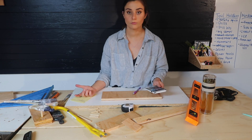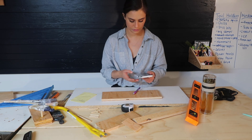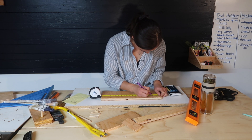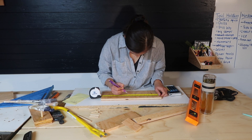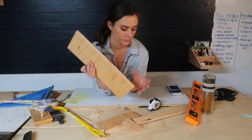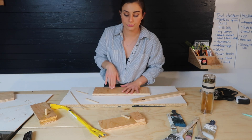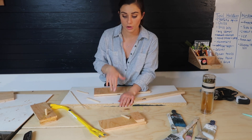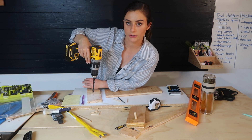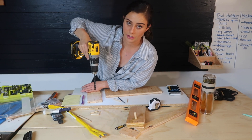I got my straight line — 14 and three quarters inches divided by seven sections equals 2.11 inches. So I'm marking every 2.11 inches along that line where I'm going to drill the holes for the dowels. I'm marking out where I'll drill my holes. I've put a piece of melamine up here when I drill holes so if I go too far I drill into that instead of my workbench. This would be easier with a drill press to get it really straight, but I don't have one, so I'm just going to make sure I go in at a straight angle.